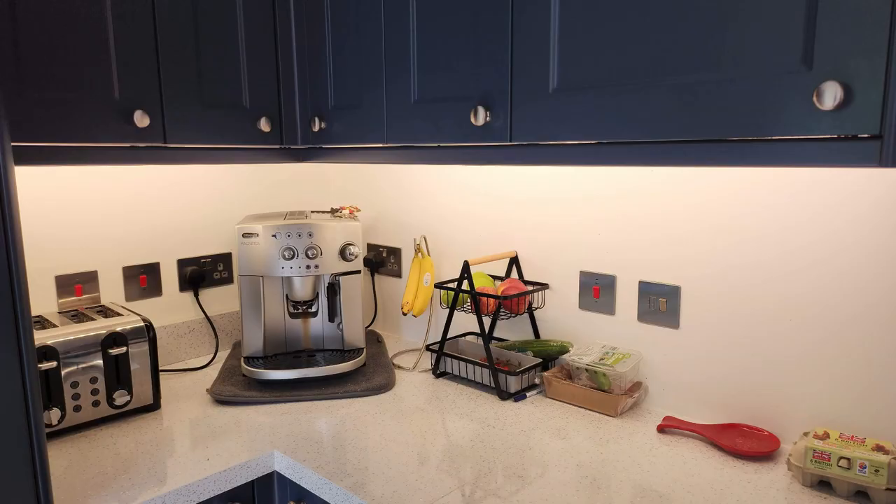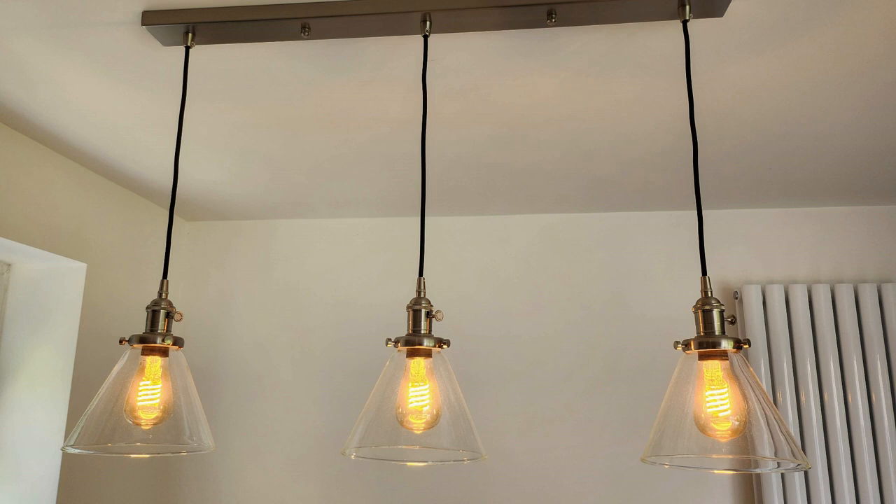My three different lighting zones are made up as follows. The ceiling lights are six standard spotlights controlled by a standard non-smart light switch, but I'm also using a Shelly smart relay to make that lighting circuit smart. The second zone uses Lifx LED strip lights under the worktop - I've never been able to get those working on Wi-Fi, so I'm using smart plugs to control them. The third area is the breakfast bar lighting, made up of three Hue filament spotlights connected into my Home Assistant environment. Motion and presence detection is handled by the Aqara FP2 presence sensor located on top of the fridge.